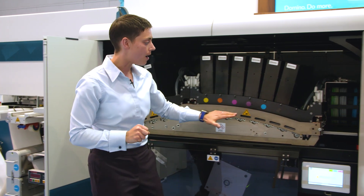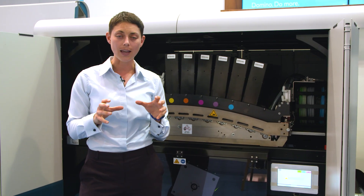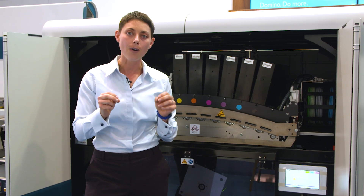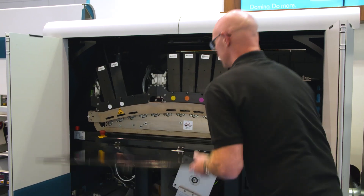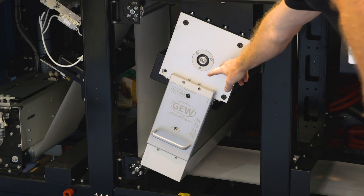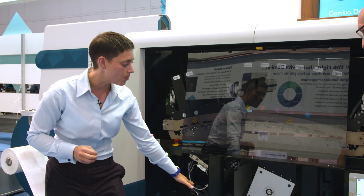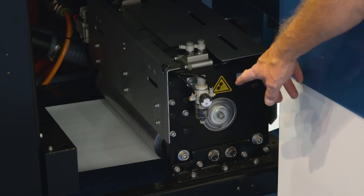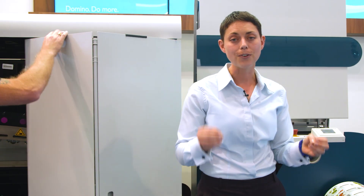After the black bar we have our second LED pinning lamp. This enables us to control the flow of the ink, which is absolutely critical when printing fine fonts. The web path then leaves the imaging arch — Keith's just going to raise this safety barrier — where we hit our chilled roller and GEW curing lamp. This enables us to handle media that are very sensitive to heat. The web path then travels through to the second nip roller, out of the print engine, and to the rewind, where we have a fully printed roll of labels printed with our new food packaging compliant UV95 ink set.